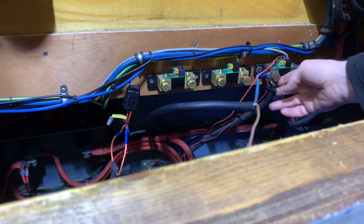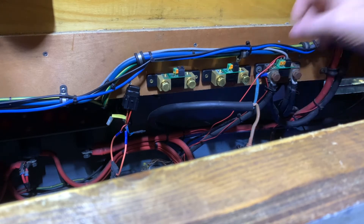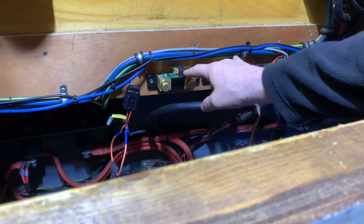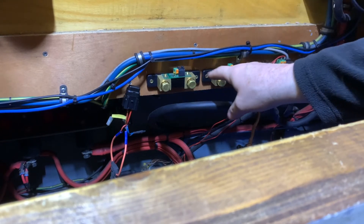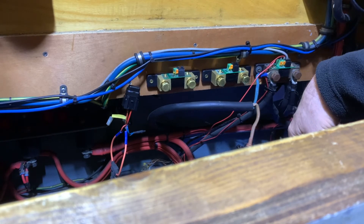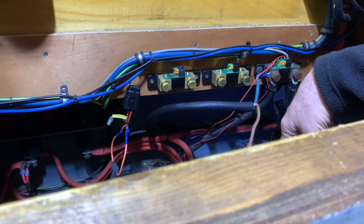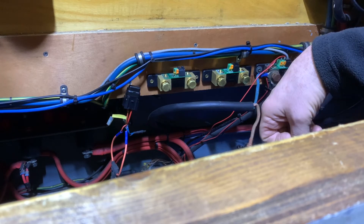This output side of the battery bank on the existing shunt — we don't need to mess with that at all. We do need to remove this and relink the batteries at the bottom when we put in the new ones, and I'll show you that shortly. The data cables from these two shunts are going to go up to the two battery monitors which are in the cupboard just behind this panel. The feeds will all go to the common join point of both lead acids and lithiums, so really the voltage read on the battery monitors should be the same on all three. It's the current that we're interested in, really.